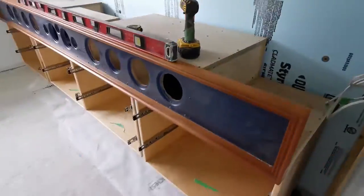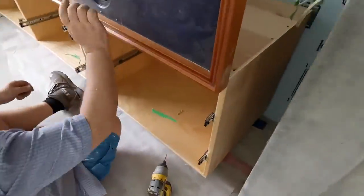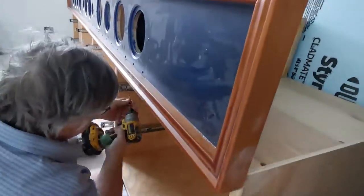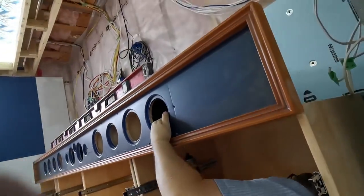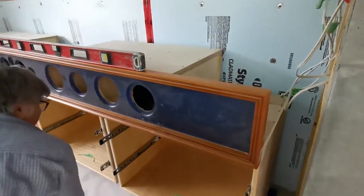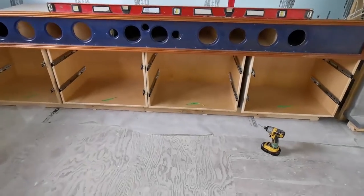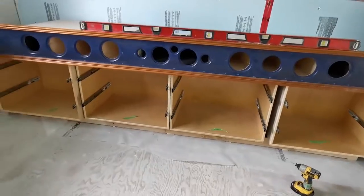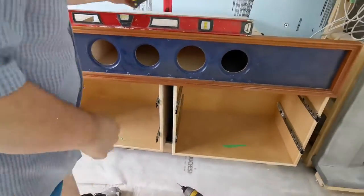drawer faces on there, I use solid wood for the drawer faces, and a lot of times, when you sand or route or everything else, it's hard to get all those drawer faces exactly flush with it. That's why a lot of other companies use particle board, but I wanted real wood. So I gave myself an out, and I always use that word, out. I wanted it to look inlay, so I opted to put a piece in between. Let's see how it turns out on the next one when we start putting that piece in.